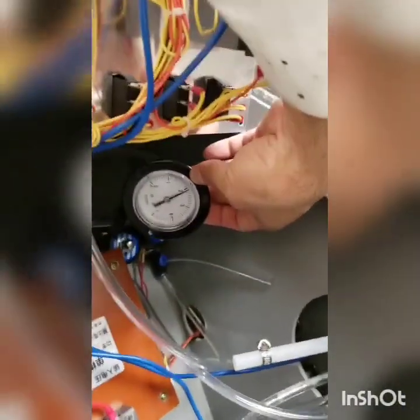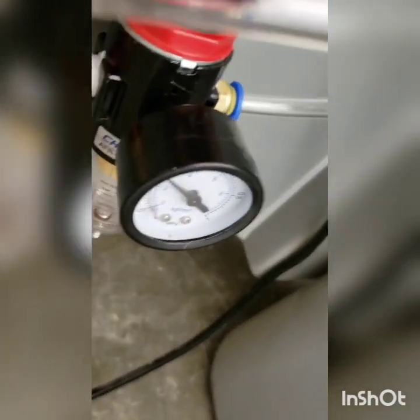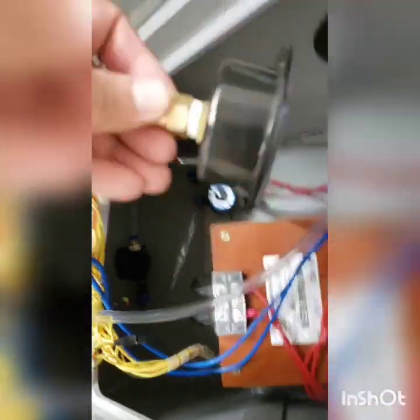And we're also getting this much pressure to that pipe, which is going directly into that. The weird thing is, first of all I'm going to release a little bit of pressure because I'm worried the pipe quality is not that good, so I will bring it back down to 1. I will also release a little bit of pressure here. Now the pressure is almost 0 there. I'm going to disconnect this gauge right over here, and now because we have no pressure from the main, I'm going to increase the pressure.